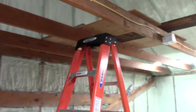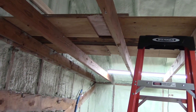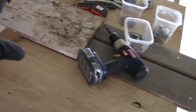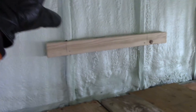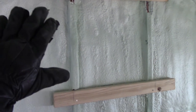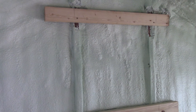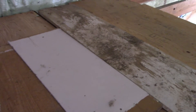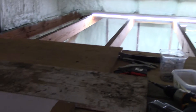What I've been doing is building this platform up here so I can get up here and work safely. This is just out of scrap lumber so I can step on this platform and work up here without falling. This is the mounting lumber for the hot water heater — it's just tacked in right now. I also have some lag screws, so I'll lag these in really tight so they're nice and secure to take the weight. It's a gas appliance — I don't want it falling, I don't want fires. So I'm going to lag those in and then I have the hanging hardware to get that water heater up there. I had to build this first just because I didn't want to be trying to balance on these beams like I'm in Cirque du Soleil or something.